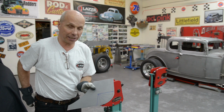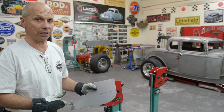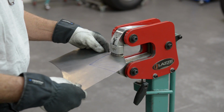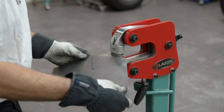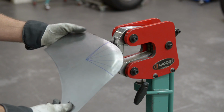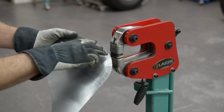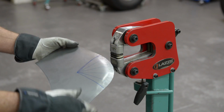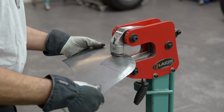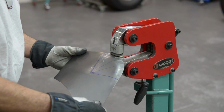So I'm using the deep shrinker to do this, and I don't need to go to the wheel and start doing this in the wheel. I can start with the deep shrinker. So I'm starting here, and I think it's a good thing if I start with one row on the edge first like this. And then you see how that looks. I used a little more pressure, so I had a little more bubble there than I had there. That's okay, because now I'm going to go with more pressure on the edge again and less all the way into that point there. So I can do 1, 2 there, and then I go further in like this and loosen up the pressure. And I can go a little light on the way back too.